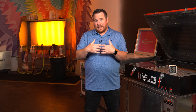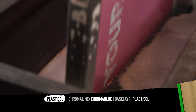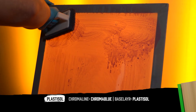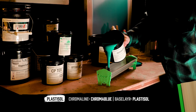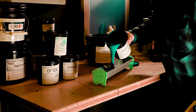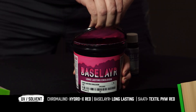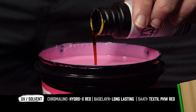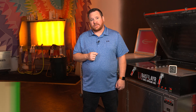When you're reclaiming your screens, keep in mind you're using a water process to reclaim those screens. If the emulsion is not water-resistant, it's going to break down easier in that reclaim process. Something like Chroma Blue is a pure photopolymer that works exceptionally well with Plastisol inks. If you're using UV or solvent-based inks, there are plenty of dual-cures or hybrid photopolymers out there, but it needs to be an emulsion that works well for that type of ink system.